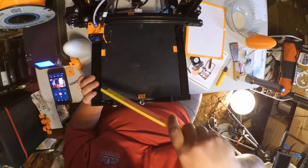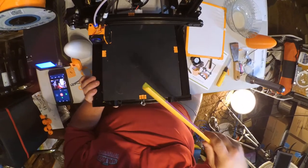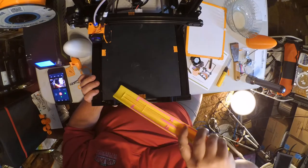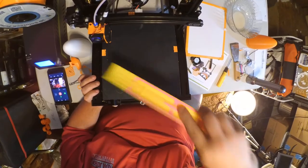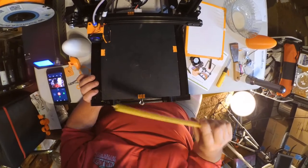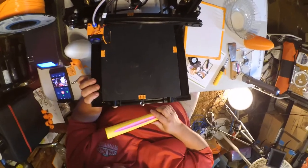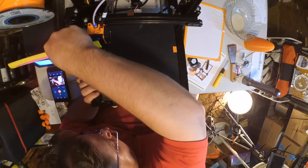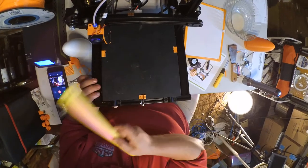You have to decide how you're going to lay it out, what you think your printer is capable of doing, by measuring it. Then you place your objects on the print bed, set your process order, and tell it. This printer is capable of going to 300, so I just set my sequential for 300. This way I never accidentally stop part way up an object and go to another one. Now, if I were to ever place two objects close together, I would have to go back in there and change that to something lower, to whatever would not conflict, would not crash. So on this printer, my nozzle, this is going to be hard to measure. I have about 22 millimeters on the left.